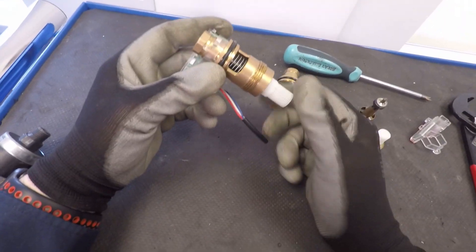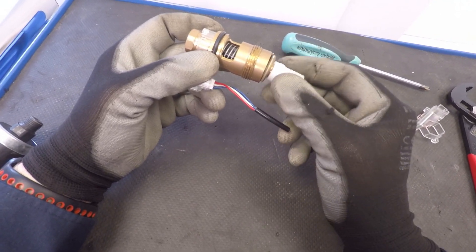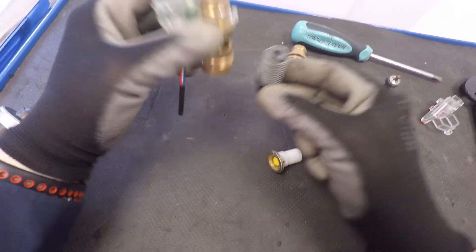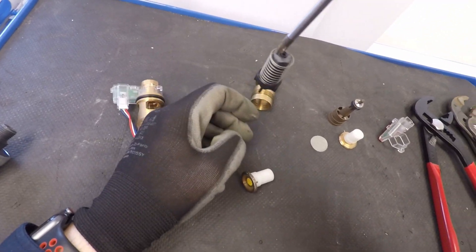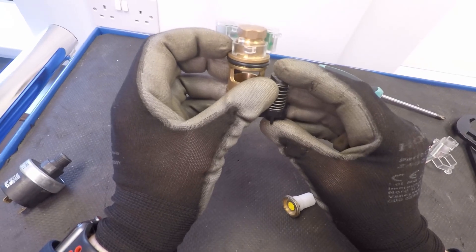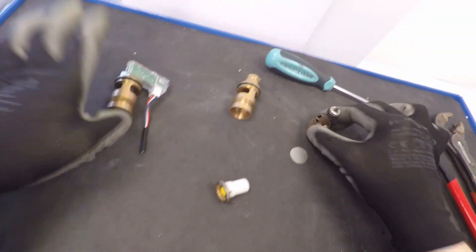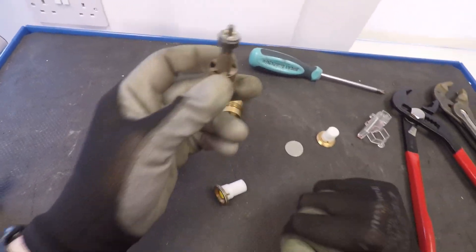The duotex and platinums use a bobbin/float switch type. If I take that one out, you can see it has just one continuous magnet. It shoots up when the tap runs and then drops back down when you turn the tap off. That is the difference between the float switch type and the turbine type.